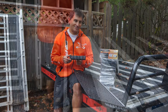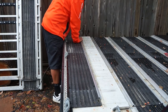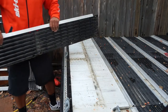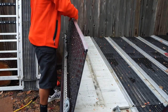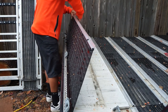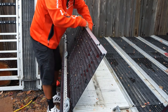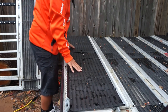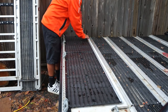So let's get started. The first thing we're going to do is drill out the rivets on the edge rail trim, then remove the edge rail trim with the regular Super Glides — it should just snap out of place. We can reuse the edge rail trim. We slide the Super Glide wide version in, put it at a 90-degree angle, tuck it in, and it'll fold into the extrusion on the Marlon Explorer Pro deck. Then all we need to do is lay it down and attach it to the deck.